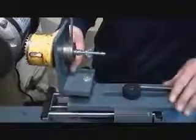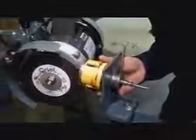You're going to want this nut up on top of the fixture so you can just swivel it a little bit — your diamond adjusting slide — so you can swivel and bring it up to your first tooth. On the back side I always round this with our diamond dresser so that way you can get inside the gullet of the tooth nicely. It doesn't have to be very precise because once you do your first one it will kind of conform into there. And put a little back relief so you don't nick your next tooth.